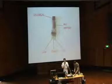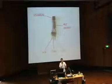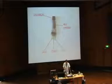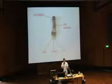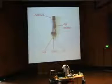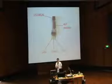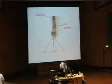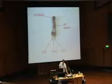Right, if you're wanting to plug these in, some of these I assembled with the resistor in the front, and some of them got the resistor in the back. But basically what needs to be done is plug it in so that the ground connection, which is the one with nothing connected to it, goes into the ground pin on the Arduino, and then it connects onto pins 13 and 12, which are the adjacent pins. So the data pin in this case goes into pin 13, connection 13, and then connection 12.